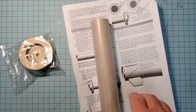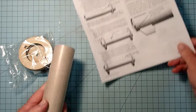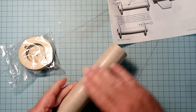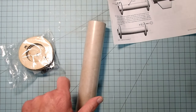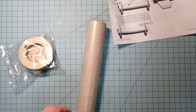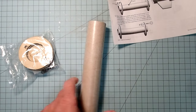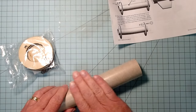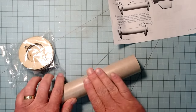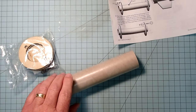We're going to start with prepping the motor mount. And something we need to do is take off this glossy surface here. Now, you don't have to strip the whole thing. But here you can use some 100 to 150 grit sandpaper. Some people like to use even coarser sandpaper, but essentially what we're doing here is we're just taking this glossy surface, this smooth surface down, and give a rougher surface for the epoxy to hold on to.